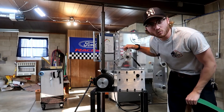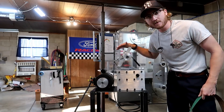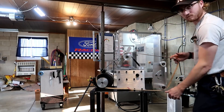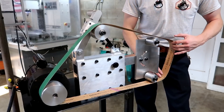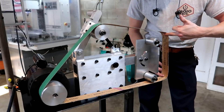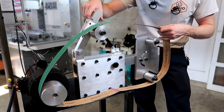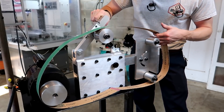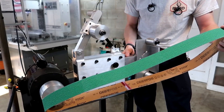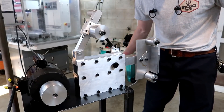Let me explain where we went completely wrong with this thing — something was hugely fat-fingered to the point where I'm almost embarrassed to show this. We're way off by a lot. We need to push this thing forward maybe three to five inches, and this is maxed out so we want it down a little so there's tension on the belt. This thing needs to be an extra five inches longer than it already is. Not a big deal, but we still went wrong in the model somewhere.